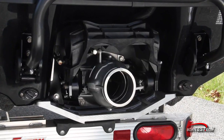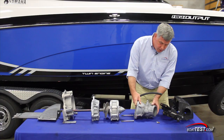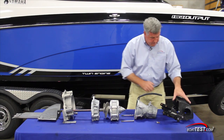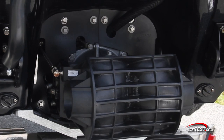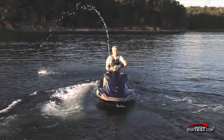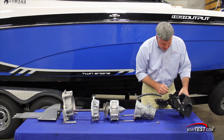This end we're all familiar with because you see it at the back of a WaveRunner. Our directional control is primarily provided by the nozzle itself, but when we need to reverse, that's where the reverse bucket comes into play. The water is being forced out, and the geometry inside the reverse bucket takes that water and shoots it back in the other direction.